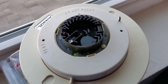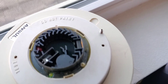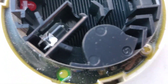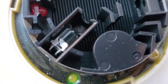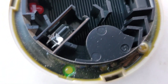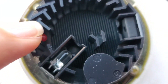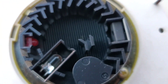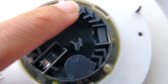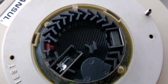This is the inside of the smoke chamber of the photoelectric smoke detector. Right here, if you look real close, that looks like an LED but that's actually an infrared sensor — it's basically a diode that senses a beam of light. We have an LED right here that shoots across, and notice that we have all these little angles right here.